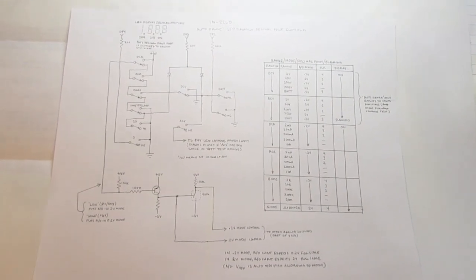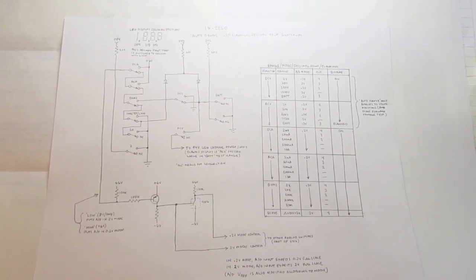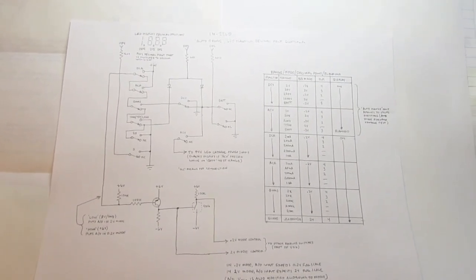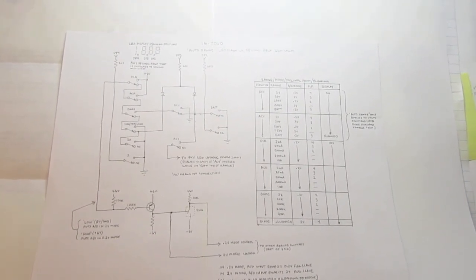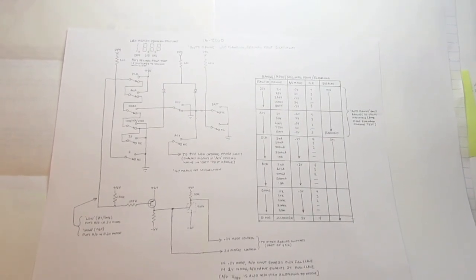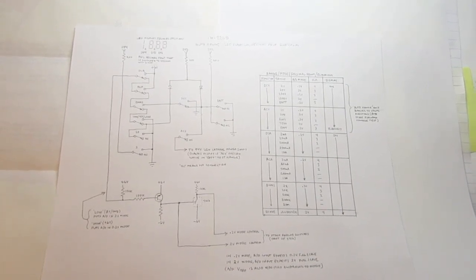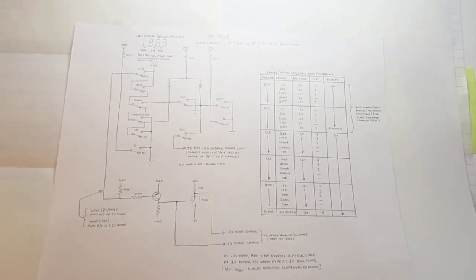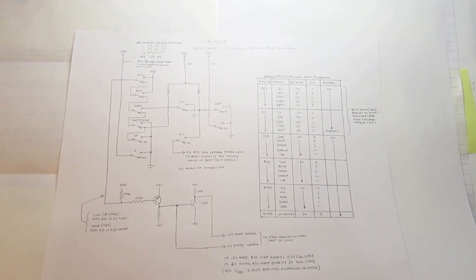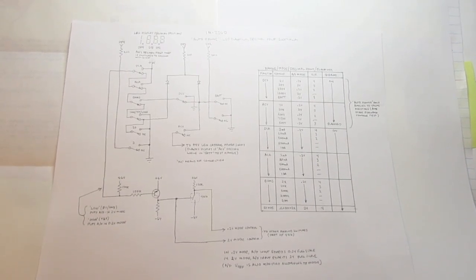Alright, well, I wasn't happy with the research I had done studying the 2260's circuitry regarding the so-called auto range that I discussed elsewhere in this video. In other words, where specifically in the voltage modes or the voltage functions, the resistor scaling divider only taps off every other order of magnitude, but the amps and the ohms modes do have resistive scaling for every order of magnitude. So it's necessary to tell the analog to digital converter to use two different sensitivities or two different input ranges depending upon which mode or which range is selected while in AC volts or DC volts.